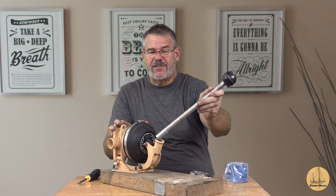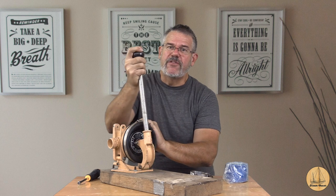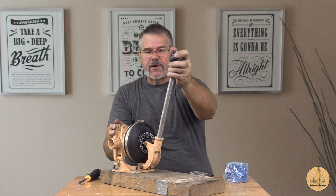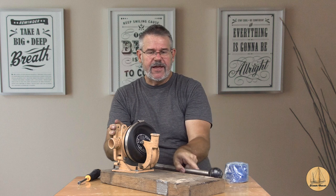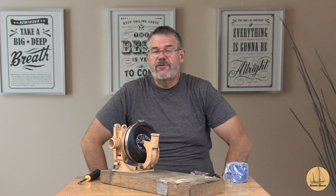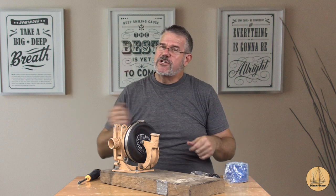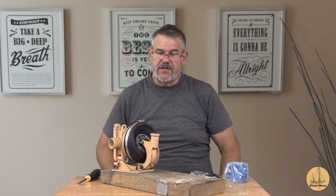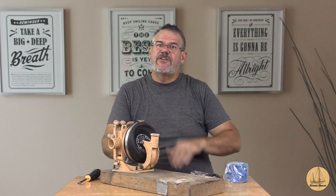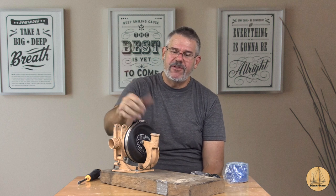What's interesting is I actually think it does work. If I put my hand along this and pump, I can feel the suction. So what we're going to do today is connect up a hose and just test it out. I want to see what kind of lift it gets, how much we can really pump. I'm going to bring one of those Rubbermaid tubs - it's like an 18-gallon tub - set a timer, pump for a minute, and see if it truly gets the 17 or 18 gallons per minute that the specifications call for. And how much does head height change the volume of pumping.